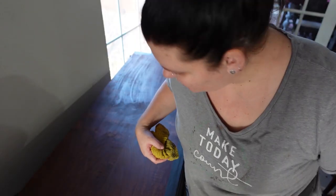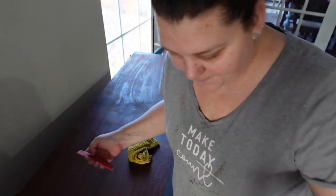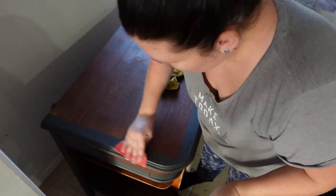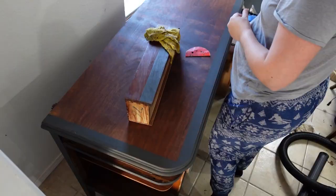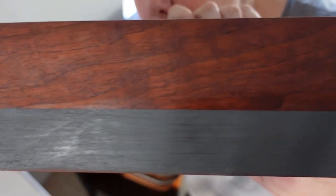Slight change of plans — I actually decided I don't want to do a second coat of paint. It might be impatience, or it might just be because I really am liking the look of when I'm distressing it and I can see the wood through it. So I'm just taking a 120 grit sandpaper and lightly going over it. I'm only distressing the painted part — I am not distressing the stained part. And it's just lightly.